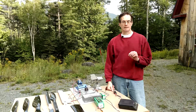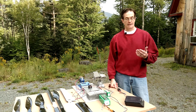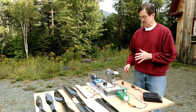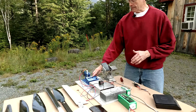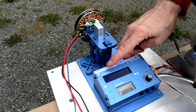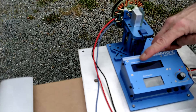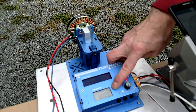This is the final installment in the series on large multi-rotor propellers, and that's the testing. I've set up a test stand that includes a power readout as well as a thrust reading. It gives you the applied voltage, the consumed amps, and the calculated watts. The thrust reading is on this gauge right over here.